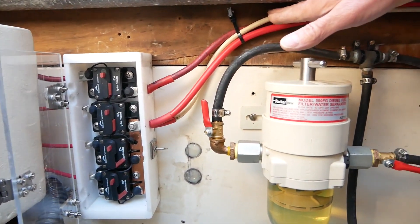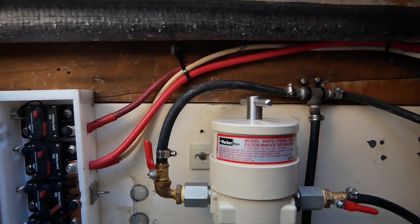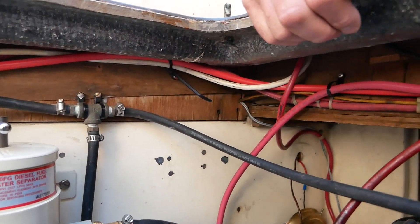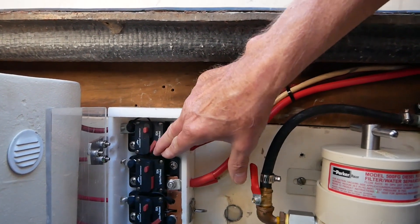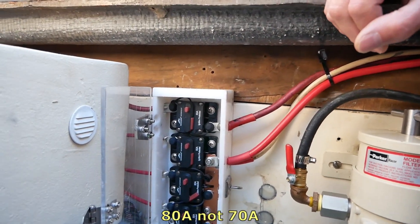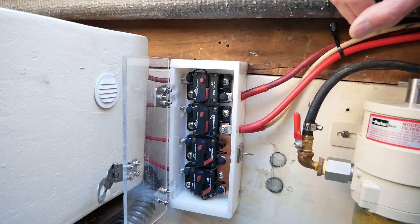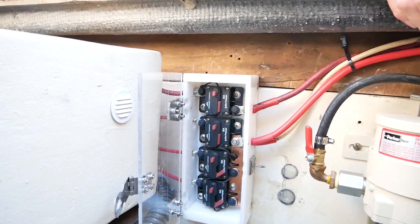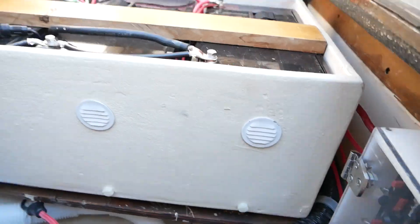The wiring continues back to the cabin where there's a two-position battery switch — the conventional big red one you usually see. The wires go up and over the fuel filter and back into the cabin. These are easy-to-reset breakers: I have a 70-amp for the starter battery, which is getting close to the limit for where you go from fuses to breakers, but it's working fine. I have 50-amp breakers for each of the house batteries, and I can turn each one on or off individually. The charging systems are on the other side of the engine compartment.